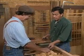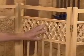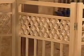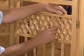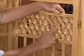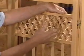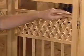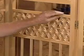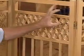I mean, you can see that all of the grills are kumiko, and this is just a special type of kumiko grill work. It's constructed. By constructed, you mean this is built up of long sticks, right? Long pieces of wood that are joined together with joints at each of these intersections. That's correct, yeah, a lot of joinery. So it's not sawed out. And what kind of wood is this? It's Alaskan yellow cedar. It's old growth Alaskan yellow cedar, picked for a very, very tight, straight grain. Well, this is a splendid use of a very rare wood.